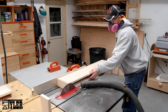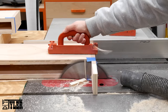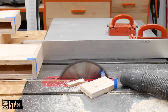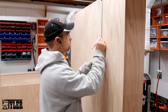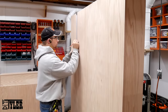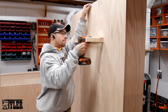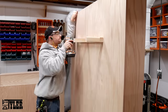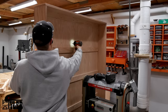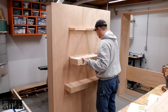I got to say, this was probably the single most terrifying thing I've ever done with a table saw. I went nice and slow, but just having the blade this high was very, very uncomfortable. I then had the wherewithal to pre-sand the back of this bed frame before adding the shelves, measured for the placement of those shelves, pre-drilled the screws a little bit, and then transferred their placement using a quick tap of my fist and screwed into place. Once they were held in place from the front, I countersunk from the back and added a longer deck screw for a little bit more support.